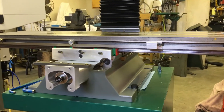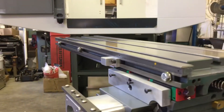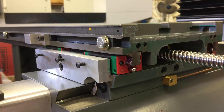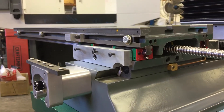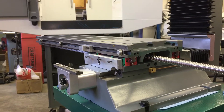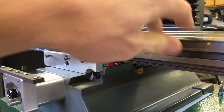Pretty gratifying. My thoughts — yeah, it's good. You can see the red grease on the ends of the cars there. It's the same grease I used when I put the ball screws back together — I think it's some DuPont, like wheel bearing grease, really really heavy. I just slathered some of that stuff in there when I slipped the table on and I was really surprised. These are medium pre-loaded rails and just with the addition of a little bit too thick of grease, you could really feel the stickiness of it. That was sort of interesting.